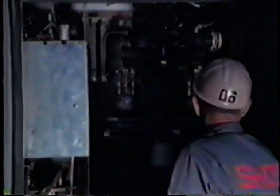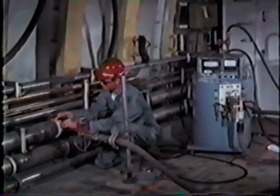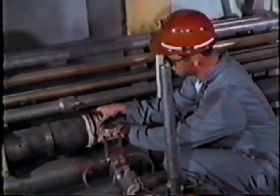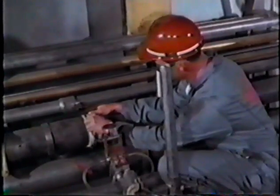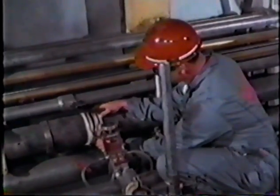For induction heating aboard ship, the radio frequency generator is placed either dockside or on deck. Power is supplied through a cable to the remote matching transformer located at the brazing job on the ship. Even the most difficult locations can usually be reached with the work coil. Brazing procedures are as in the shop.